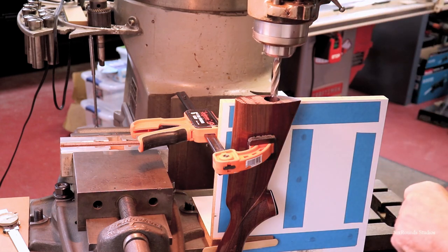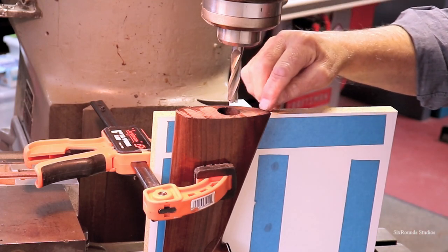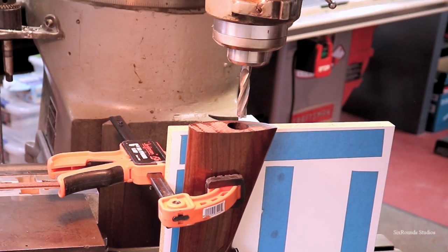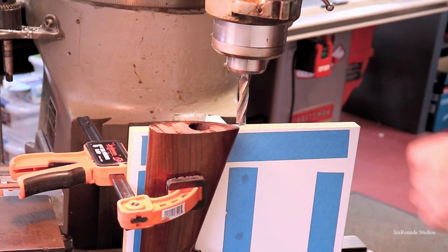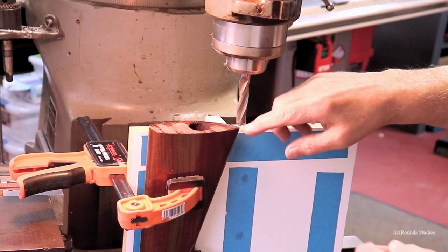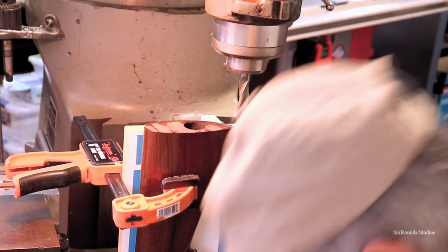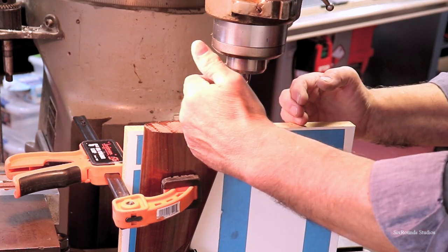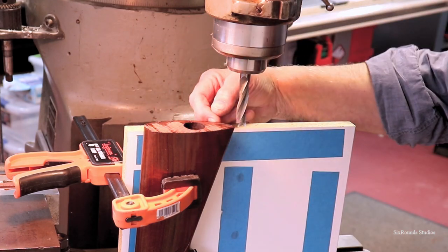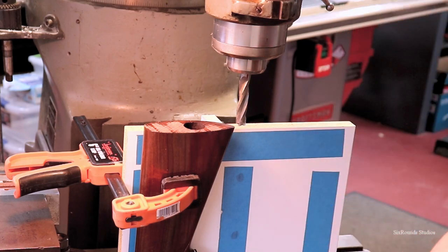So next thing we're going to do, again, I've got this low spot over here, which is the biggest low spot that I have to get off. So I'm going to turn around and cut this, probably only a few thousandths at a time, because I don't want to put a lot of stress on the wood. And I'm going to use sort of a conventional mill, where the cutter is turning into the wood. So I'm literally pulling the wood into itself with the cutter, and I'll come around the outside edge doing the same thing, so that I'm pulling the finish in the wood into itself. That'll help prevent as much of the chipping as I can. And then once I get into the center, it's not such a big deal. All right.